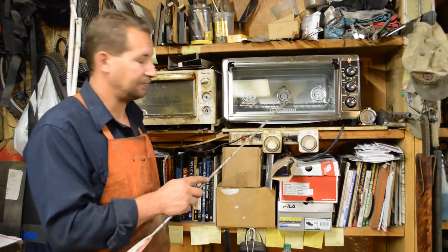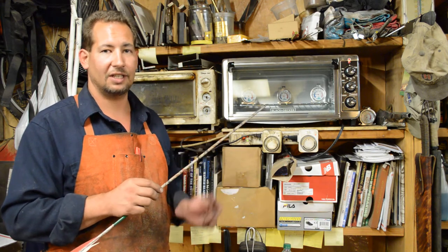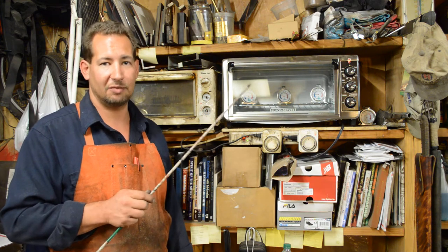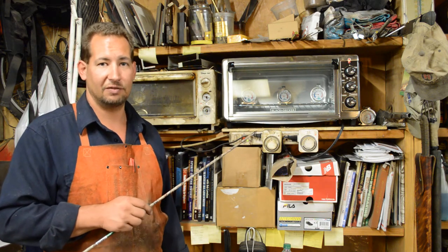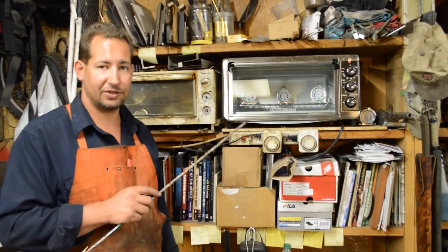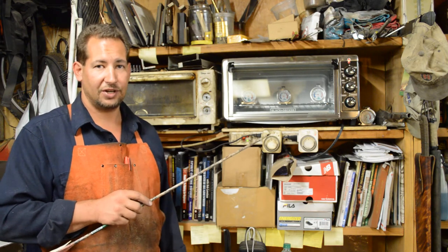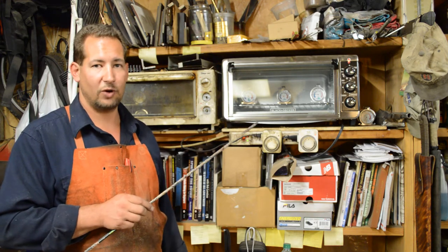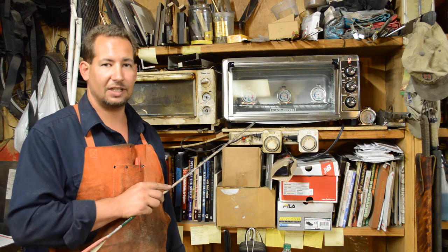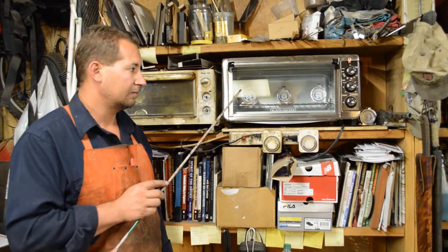When you go to set up a new oven, even your kitchen oven at home — big, nice, lots of insulation, very good controls — my appliance guy says even your kitchen oven can cycle 75 degrees above or below your set point, or at least that's what he's seen over the years. Yours at home might only go 25 degrees, and a lot of times the temperature settings aren't accurate for what's actually going on inside the oven. This Black & Decker was $70 brand new — it doesn't have near the insulation or controls that your kitchen oven does.